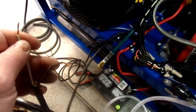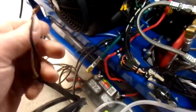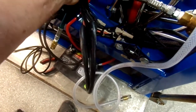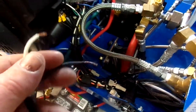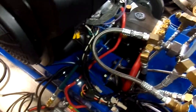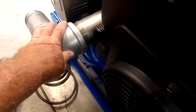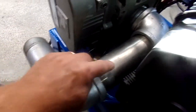What that does is that when it goes in the up position, this side is ground, which is tied to your chassis ground, and that collapses the white wire here, which will be attached to these groups of wires over here. So when the water comes up in your tank, it'll collapse the field on your magneto, halt the engine, and keep water from inducting through your return line of your filter in your tank back through your blower. The direction of airflow is coming from the tank over here, in, around, down, across, and then down into your silencer.